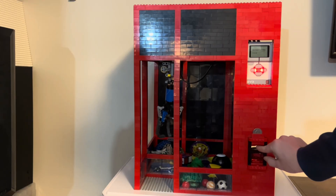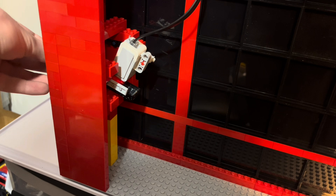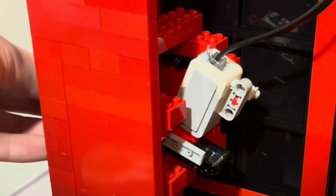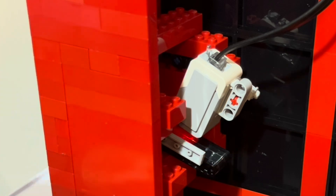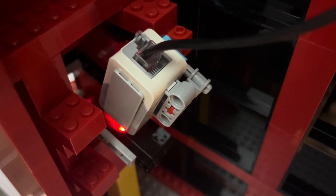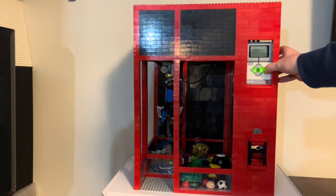So now let's take a look behind the scenes. When you insert a quarter into the machine, it rides on top of those two rails and under that color sensor. If you insert a coin of lesser value, it's not large enough to stick on both of those rails and instead falls in between and into that gap, out of the machine.